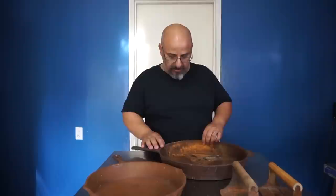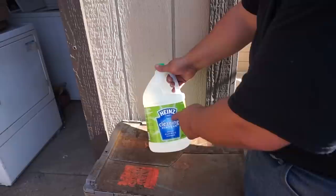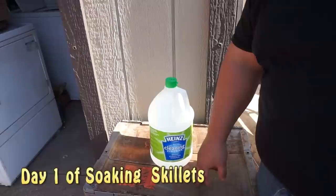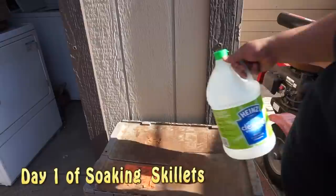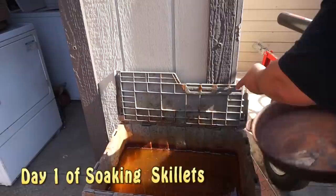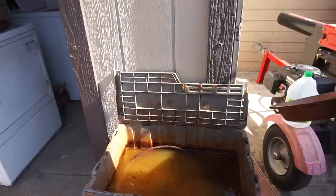Let's go ahead and put it into the tank and I'll show you how I get it done. This is the cleaning vinegar you use. When you make a tank like this, make sure you pour the whole gallon in there and fill it up with water. Just make sure when you fill it up with water, you leave it where it's going to go because it's going to be very, very heavy to carry around. I've already had this solution in here for about 20 or 30 soaks of cast iron. Let's go ahead and open it up — this is the way it looks. It's all rusted up because I've already previously used it. Let's go ahead and put this 14-inch in and get it started soaking, then we add the other one.